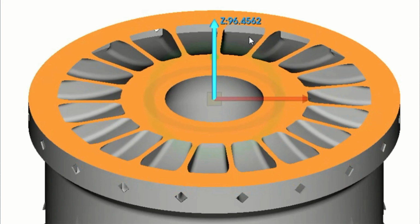Yeah. So let's explain a bit more what I meant by geometric boundary conditions. This is a good example. I talked about the contraction of the melt pool, and I actually prepared a bunch of cards because I think it's a great way to show what's happening. So we have a single layer, and this is now our solidified material. And basically the residual stress that I talked about, due to the melt pool contraction, makes that layer want to warp like this.